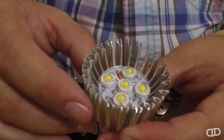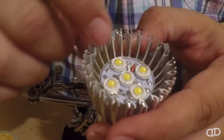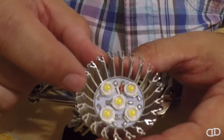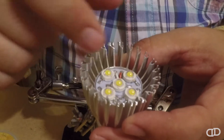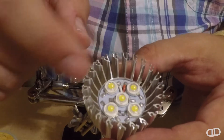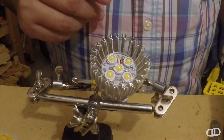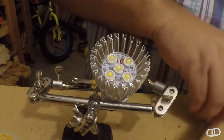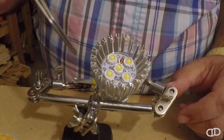The GoPro won't focus for me, but anyway — the boards are usually marked with positive and negative sides once you get the LEDs off. Also, these LEDs, if you look kind of close, the negative side has a little notch cut out of it, so you can remember that. You also get freebies right here with the red and the white. Take note of negative, positive orientation. I'm going to rip all these warm whites off because I only want to use one and I'd prefer to use ones from the same manufacturer. I'm going to do the UV in the middle, a warm white, royal blue, royal blue, and then the regular blue.